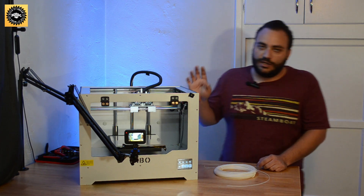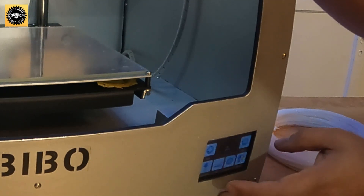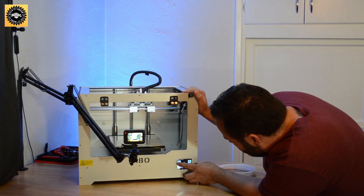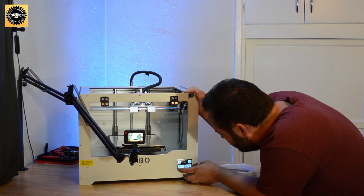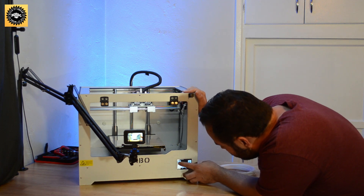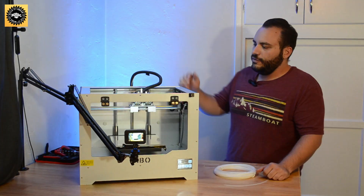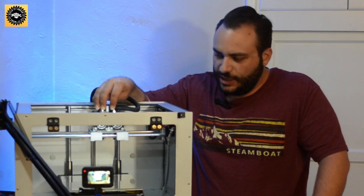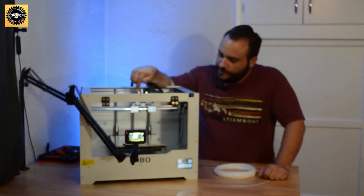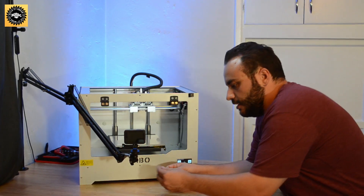So I'm going to go ahead and get the printer up to temperature here. Preheat extruder one — I had ABS in here previously, so I'm going to go up to 240, and extruder two as well; actually I think I'm going to go to 250 on both. We're going to let that heat up. I already pulled out the ABS that was in here, but in one I had a black and in the other a teal colored filament. While that's heating up, I'll show you guys on the close-up camera some of the other pulls I've done with this in the past.